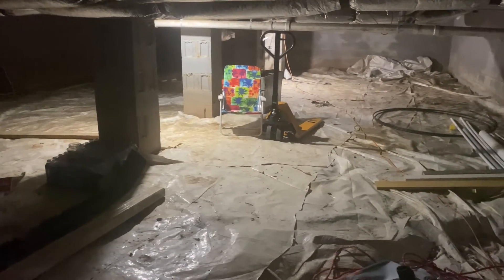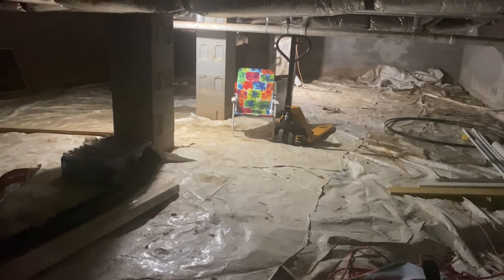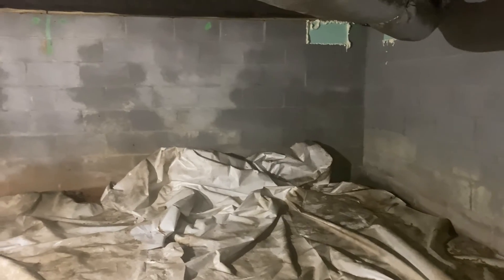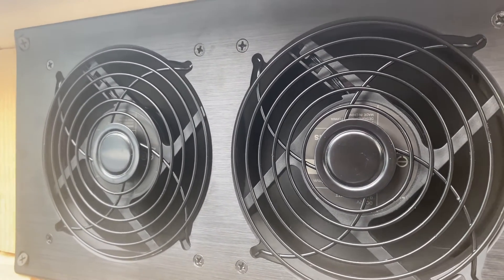I'm trying to do some work in here as far as encapsulating and replacing some of this vapor barrier that was put down very poorly. It's supposed to be laid down uniformly, overlapped six inches, and then taped — none of it was overlapped properly or taped; it's just in bad shape. What you want to do is put a vapor barrier on the wall and on the floor, overlap it, tape it, seal all your vents, and have this exhaust vent fan installed. That way, if there are any gases coming up from the ground, it'll pull and vent those out. These are all important steps to encapsulate your crawl space. Also consider adding a dehumidifier — I'll do that as a last resort, and I'll let you guys know how this goes.